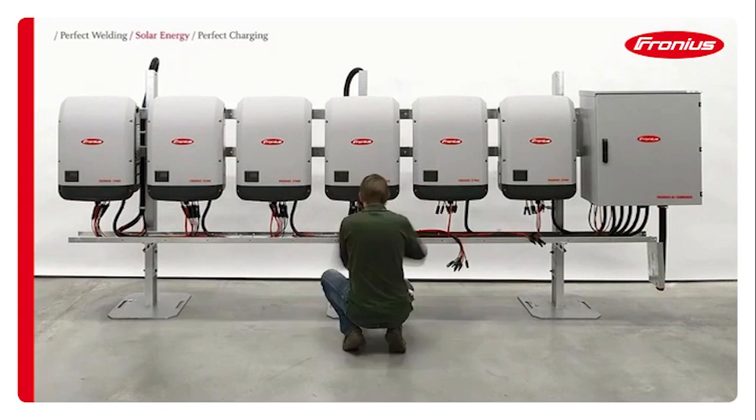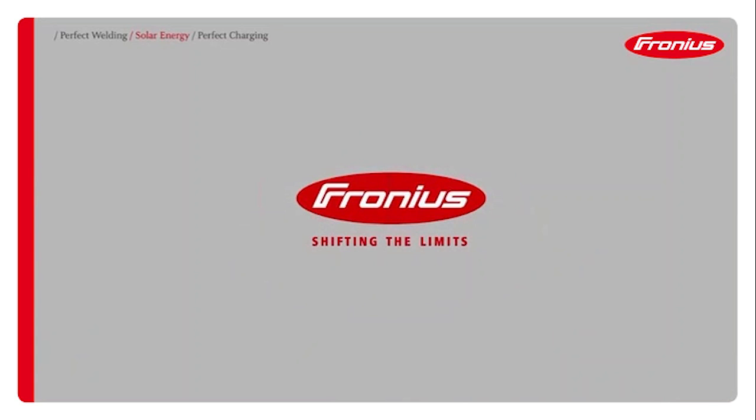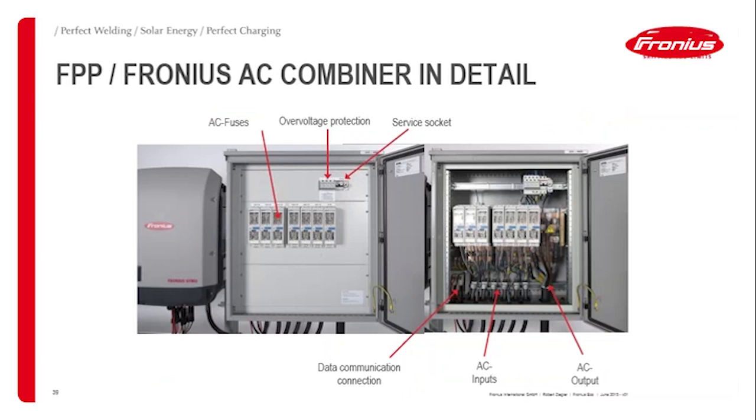It's optional. So you can even combine Symo or Eco units here to get flexibility in the system design. As I said beforehand, you can choose to use these pre-manufactured cables, monitoring if that is required, and so on. So it's basically a customized package. Looking into the combiner box, for example, the fuses, you can choose with or without fuses, and also different fuse ratings, as well as overvoltage protection, like AC overvoltage in this case, or even a service socket, if you want to plug in or use some power tools out in the field and you need a power point. So there would be a possibility for that.